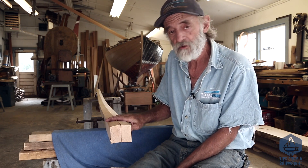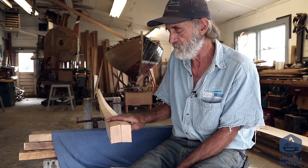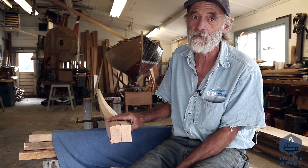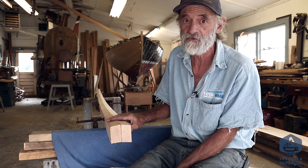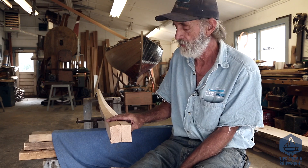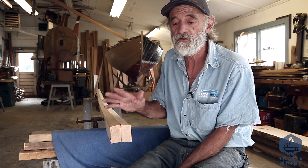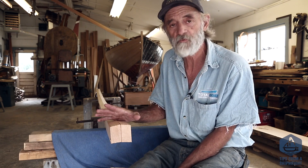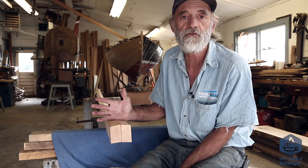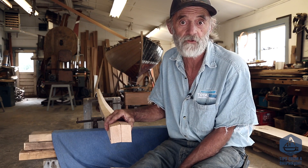They are the right wood to use for a boat like this. Now many of the viewers have asked me why I would use red oak in a boat like this at all. Well, I've built many, many skiffs over the years. I've never used anything but red oak, and I haven't seen any other skiff builder use anything but red oak either. One of the reasons is that white oak is prohibitively expensive and very hard to find. Even if you found a piece this long it might have grain problems, all kinds of problems. One of the other reasons is that this boat is only expected to have a lifespan of maybe 30 years. It's going to die from some other reason — ice damage or who knows what — but it's not going to fail because of the chine logs.